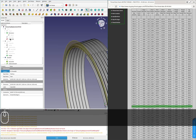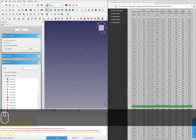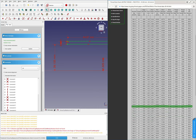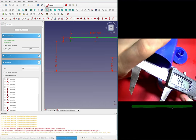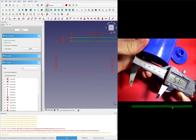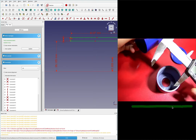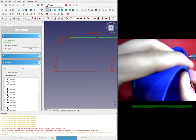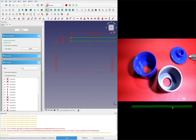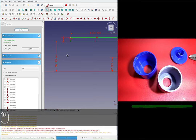Let's come back to this revolution and see what's gone wrong. Our minor diameter should be 53.376 — switching back to the camera I can measure this and we're getting 51.5. My guess is this might be some custom thread — maybe it's not actually this thread profile I think it is. So we're just going to go our own way and blaze our own path.